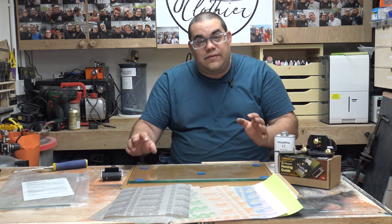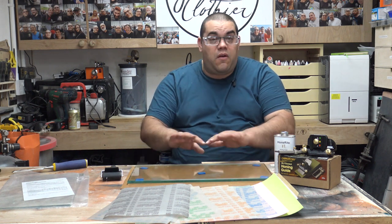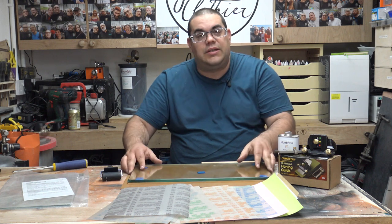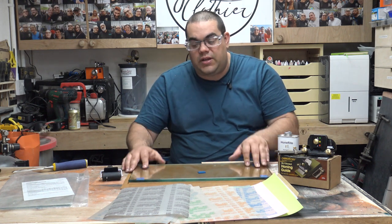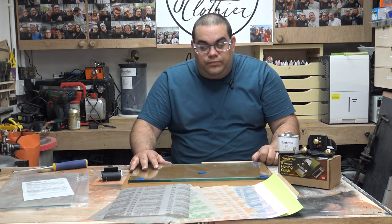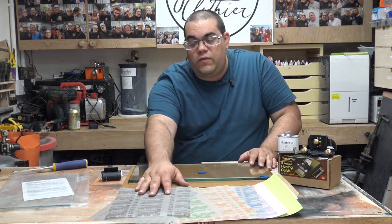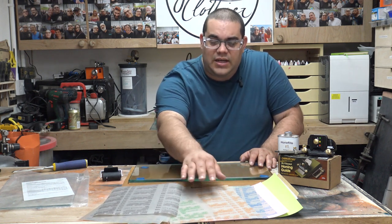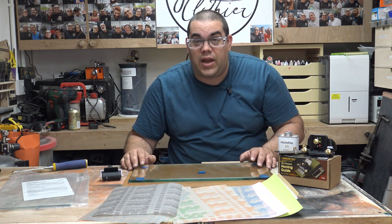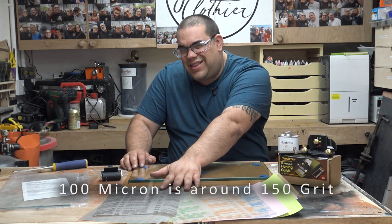The first thing is the glass. This is float glass, about 10mm thick, which means it's really really flat — technically it has the same curvature as the earth, but for our purposes that is flat enough. It comes with some little blue pads on the bottom for grip and to keep it flat on a slightly uneven surface. I also got this piece of leather to keep it sturdy on the bench. Now the papers: they don't talk about these in grits but in microns — we start at 100 microns and go through 40, 30, 15, 13, then down to 9, 3, and 1.